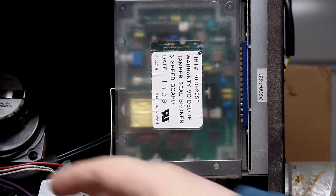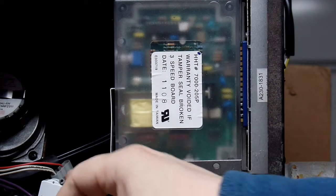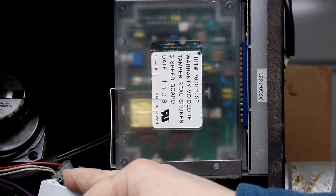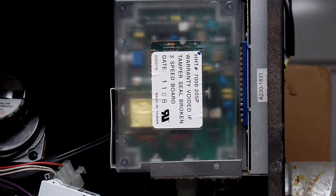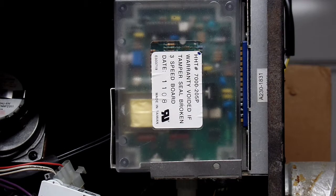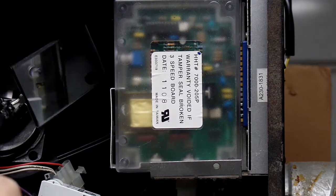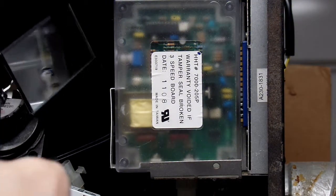Let me turn it on — we'll hear the fan come up, and look for that little light over here to tell me when the auger comes on. So turning on, there's my blinking light — the blue light should start blinking and the fan should come on. You can hear that happening. And we see the auger is not on, mostly because I'm not calling for heat.